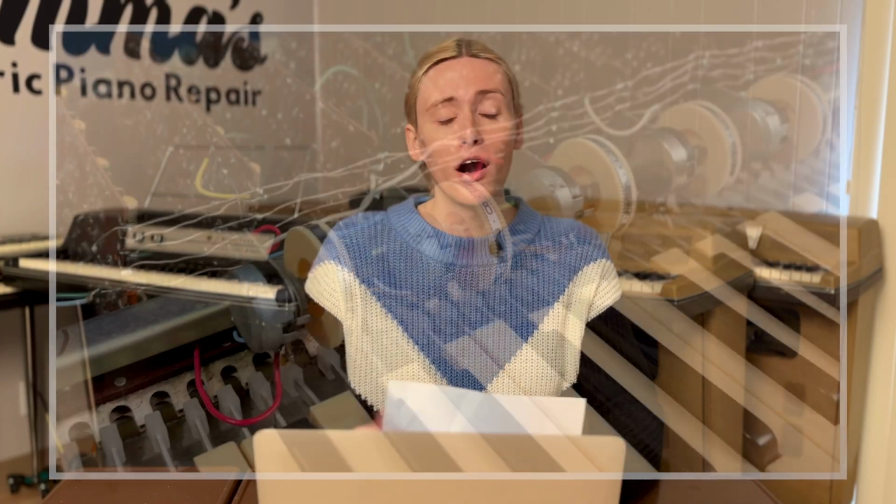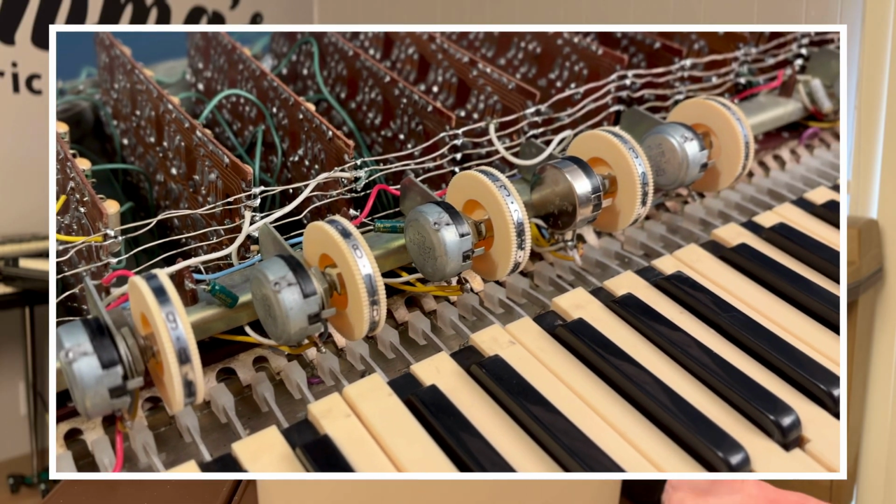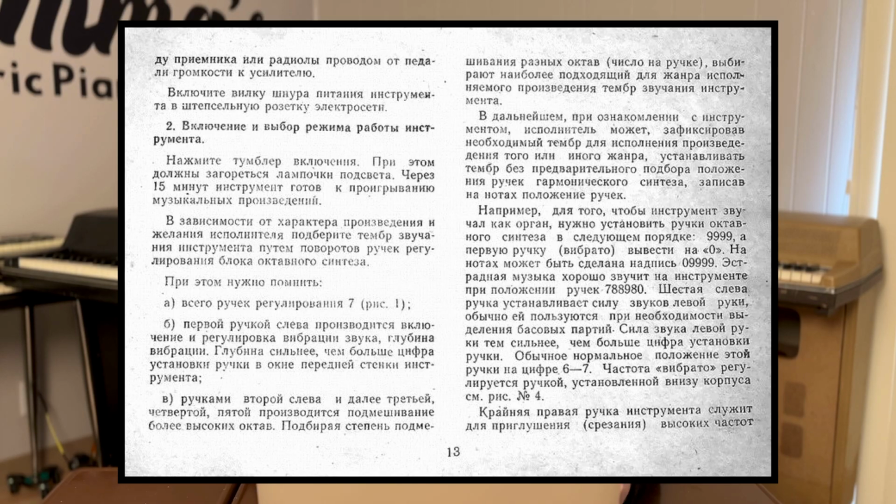From 0 to 9, you can get a stronger or non-existent vibrato from your output signal. The middle 4 knobs from left to right are your drawbar options, and that indicates how much or how little bass and treble you want out of your tone. This is kind of like an organ with drawbars, but they don't actually specifically name any length, so I can't give you a specific on what each one actually increases or decreases. For those not organ-minded, that's pretty much your tone controls. If you want more bass, you go for a lower drawbar. If you want less treble, you bring down the top.